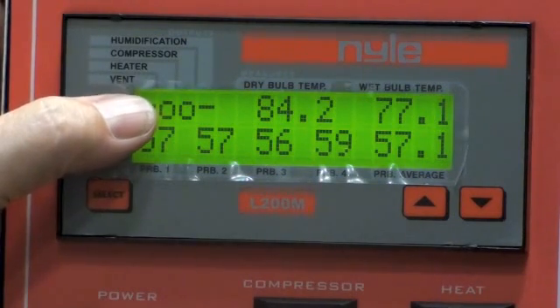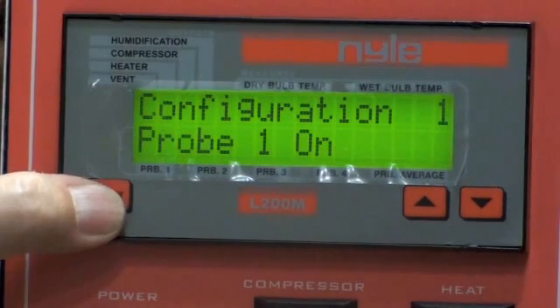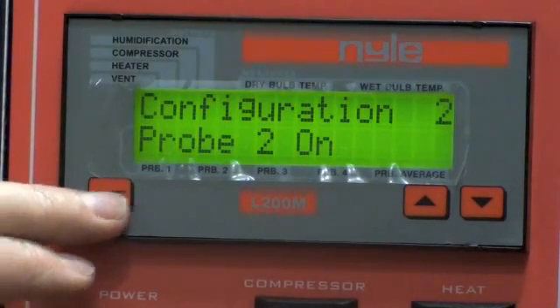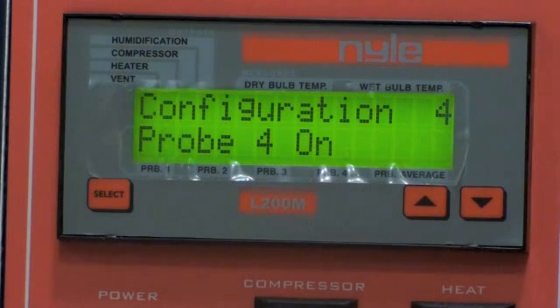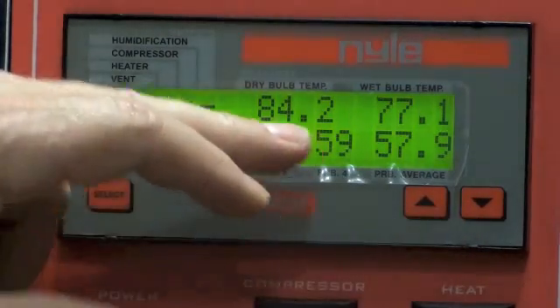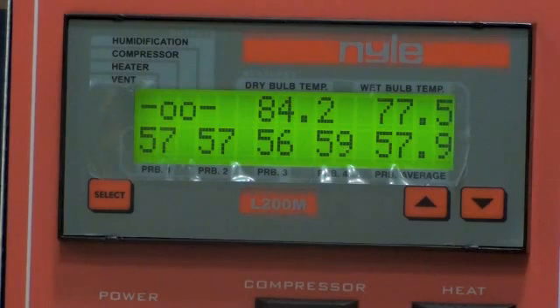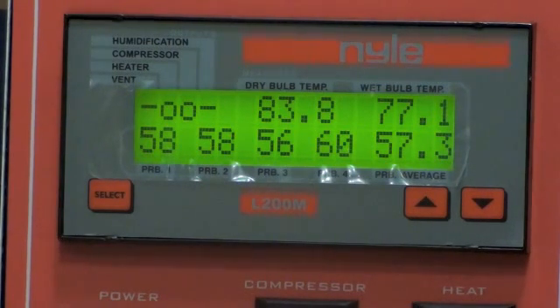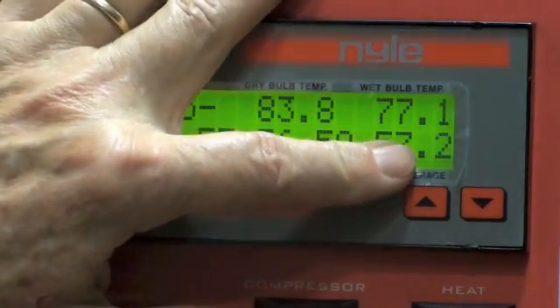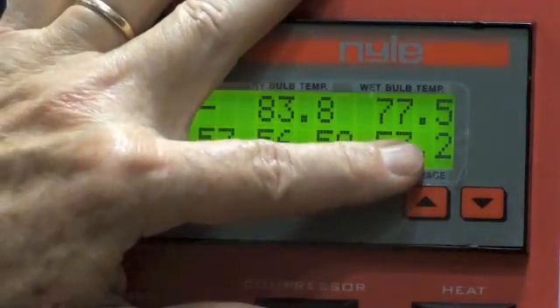The first values you see here are the wood probes. Here we are — wood probe 1. They appear in order 1 through 4, and you can't set a value here; all you can do is toggle them on or off. You'll see that probes 1, 2, 3, and 4 are all on — that's pretty much the way you want them. To turn them off, go to the select key, press it repeatedly until the appropriate probe shows, then toggle the up and down keys until the screen shows a negative. Probe readings will be visible unless you turn them off, but you may not turn them all off — at least one pair must be on while your kiln is operating. Note that the four pairs of probes do not show a decimal value, but the fifth one — the average — does. Decimals are calculated; they don't show on individual probes, but they do show on the average.